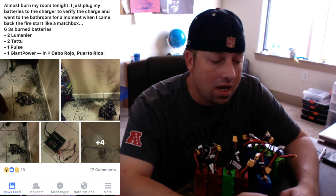Now read through the article real quick, or the post, and you'll see this guy says he was actually charging 3 or 4 different brands. I think 4. He says 2, 2, and 1 and 1. Supposedly all the same. He was actually just checking voltages, whatever. Walked away, came back, they were on fire. Well, guess what? He lost a whole brick, 6 batteries. And the reason he lost 6 batteries is because he was trying to parallel charge.